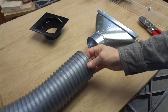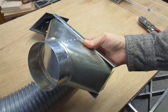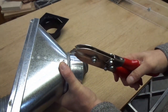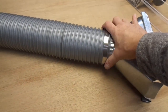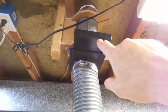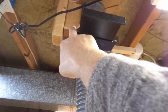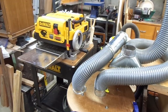This Harbor Freight hose doesn't quite accept four inch HVAC fittings — it's awfully close. I think I'm going to be able to use this crimping tool to decrease the diameter and get that to work. I have it on the clamp and it seems to be holding. The other end of the hose is up in the port in the ceiling. With these Harbor Freight blast gates, when I turn the dust collector on it tends to want to close the blast gate, so I have to put a piece of tape on it to stop it from partially closing. I guess that's a feature.